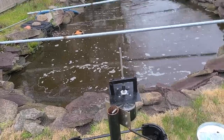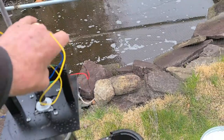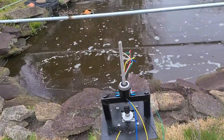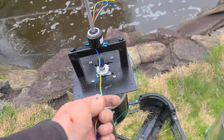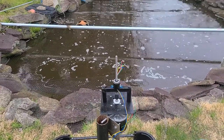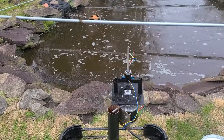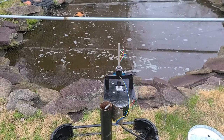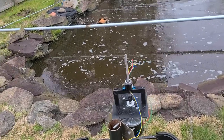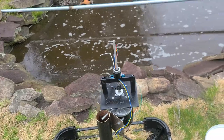I'm going to put a slip ring on here, and what this allows it to do is this part rotates with the shaft and allows me to put lights on the top of this bar and put the power and the data lines for the little microcontroller that I'm going to use to individually address the lights that I'm putting on there. They're individually addressable lights. I'm going to run an open-source program called WLED that I can control from my phone via Wi-Fi and talk to this microcontroller that puts power and data into these lines here and come out of these lines here to light the LED strips.